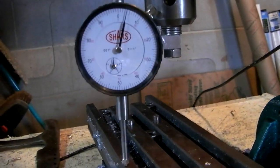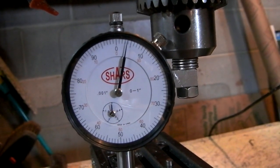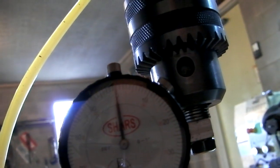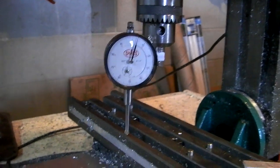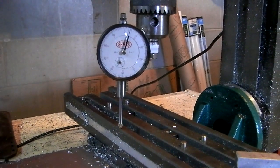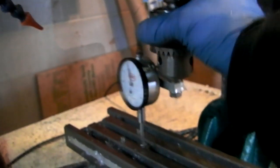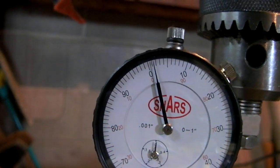We're much closer but not quite there yet. The front edge is 0.004 inches, and rotating back to the back edge it reads roughly zero. So if the back edge is zero and the front edge is four, it's still four thousandths — hugely better than 17. But while I've got it all apart, I'm going to make it perfect. So I installed a six thousandths shim — you can see it's about zero on the back edge. Moving to the front edge we have one to one and a half thousandths, and I'm going to call it there, that's good enough for me.